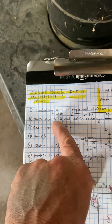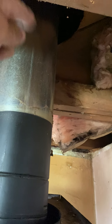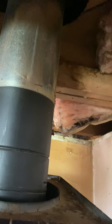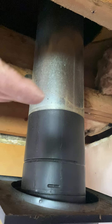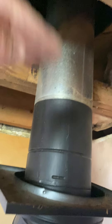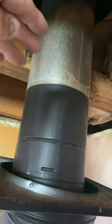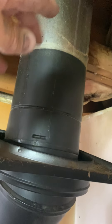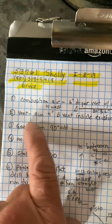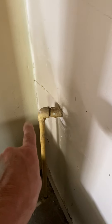For the vent, this B-vent — we're going to cut it up here and run four inch B-vent up through the roof. On the roof, I gave you a six inch drip cap, so you can take that off and go through the six inch aluminum drip cap, or go through the cap that's there — whatever you prefer. I gave you a five-footer and a two-footer, and you're going to have to offset over to the furnace.